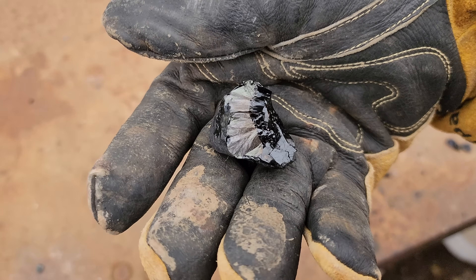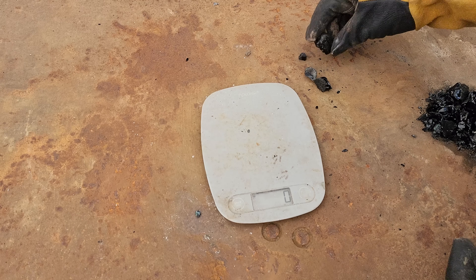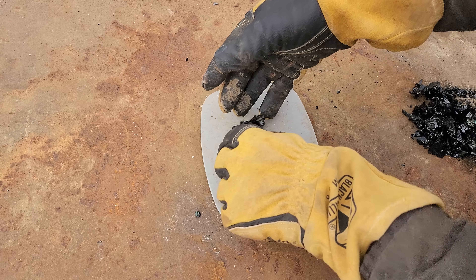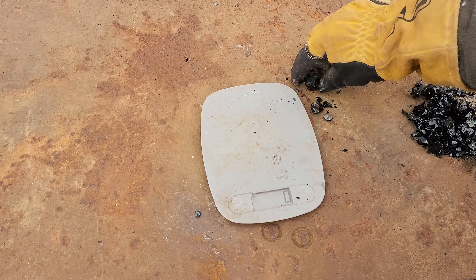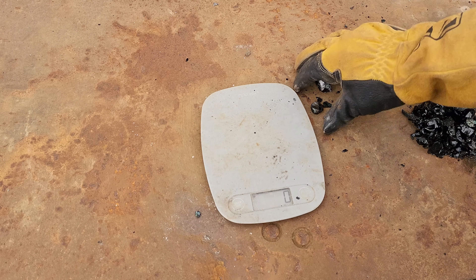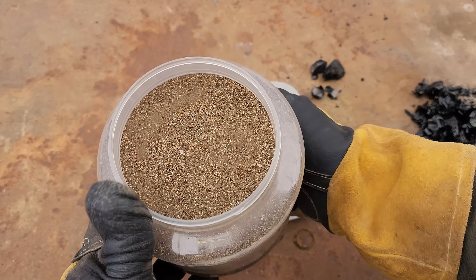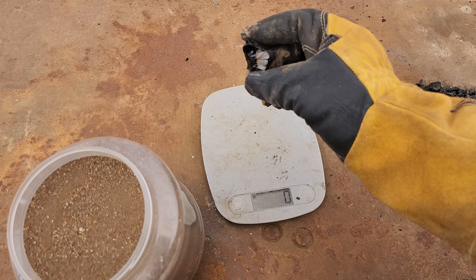Here's another example of it - the slag just sits right on top and the mat sits underneath. I've separated out our mat and our slag. There's still some slag on there, but all the mat is here in these four pieces. It weighs 46 grams. There's probably about 10 grams of slag still on there, so we probably have about 33 to 35 grams of actual sulfide mat. So about a third of this material is sulfides - the rest was taken up by the flux. That's actually pretty good. I was surprised at that much reduction - I thought there'd be 85 or 90 grams of mat.